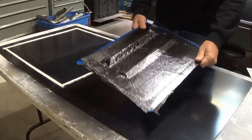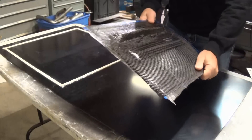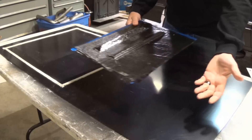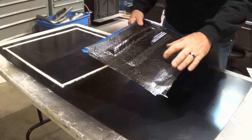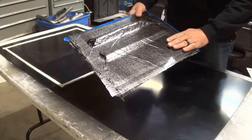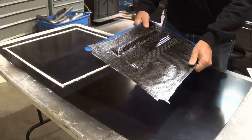All right, now it's nice and hard. It's got a little bit of flex to it, which it should. Most people think carbon fiber shouldn't have any flex to it, but if it was brittle, it would be fiberglass. That's part of what gives carbon fiber its strength. If it's brittle, it's not right — there's either too much resin or it's just not done right. It shouldn't be brittle whatsoever. It should be this strong and have a little bit of flex to it.